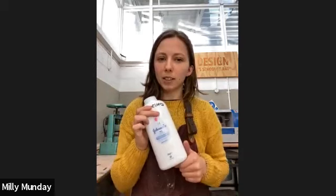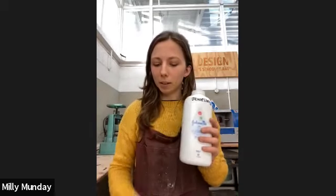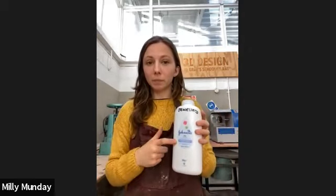I can't remember if I said about the talcum powder at that stage, but once you've laid it all out in your first half, so you've got your funnel, sprue, model and locks in place, then you'll dust it with talcum powder. Because the talcum powder acts as a release agent. That's really quite important so that we're able to separate the halves. So that's what I was talking about as a pro, is that because we've got a release agent, it should come apart with relative ease.